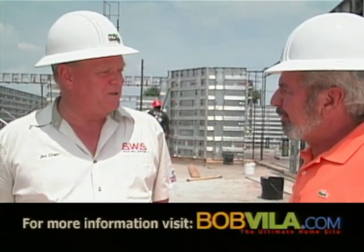Is it primarily becoming popular in the Sun Belt? It's taking off more in the state of Florida than anywhere — there's more motivation locally because of the inclement weather for a more secure home. It's perceived as a much more sturdy way of building a house. What's the growth been like? We've experienced about 30% a year over the last five years. So the number of new houses being built with this system is enormous. I heard the set of forms itself is worth about $150,000. Actually, this set here is probably closer to $125,000 — and that would include the form baskets and everything. You're going to get a lot of use out of them.